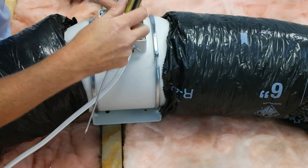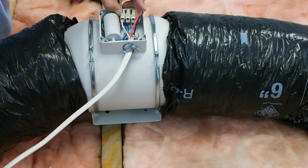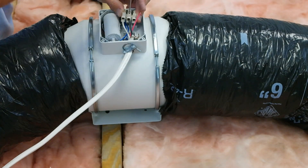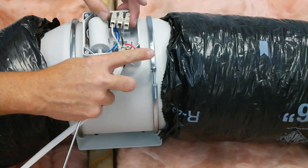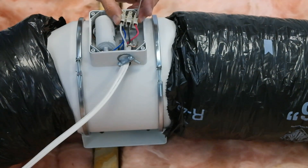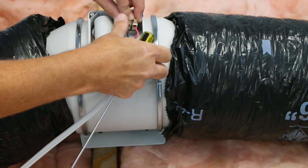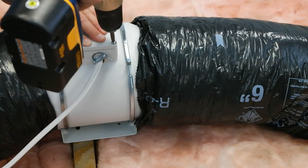We will be wiring the fan to use both high and low speed. The white lead wire will be installed first, then the black wire for high speed, and then the red wire for low speed. If you only want your fan to operate on high speed, cap the red wire and tuck it into the junction box, as this wire will not be used. Once all the wires are secured, replace the junction box cover.